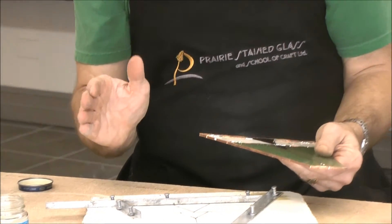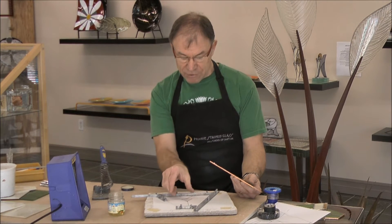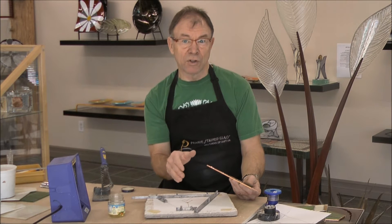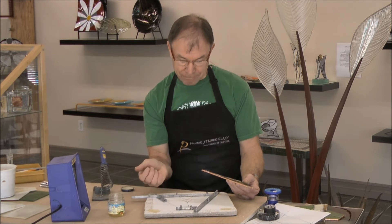It's really important to remember to leave the layout block panels where they are because I want all of my pieces to be exactly the same. If there's any movement, push everything to the outside — because if I have my outside dimensions all consistent, whatever irregularities I have on the inside of the panel will not actually be a problem later on. You may end up with a wider gap than you want, but that's because you need to take more time cutting and grinding.